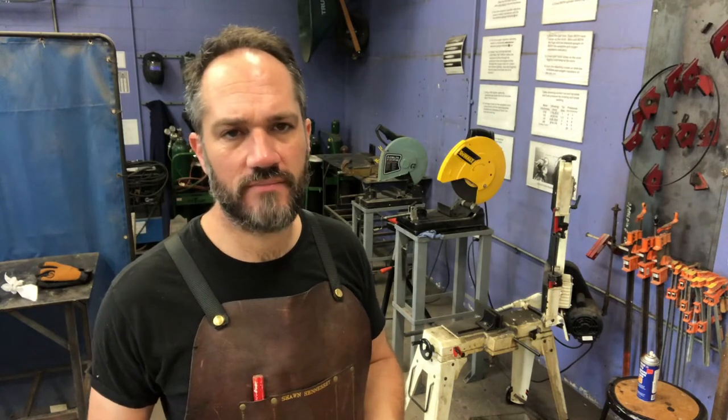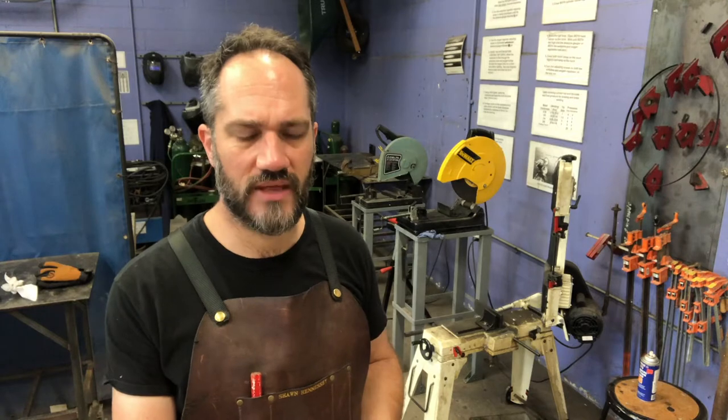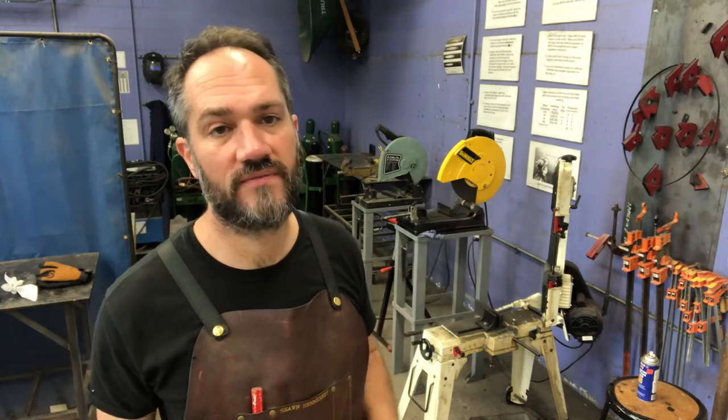You'll also notice that these tools tend to be very dirty, as is everything down in the metal shop. Whenever you work with metal and cut or grind it, it throws off carbon, making a very fine black dust that gets in everything — you can see it on my hands and I've only been here about five minutes. It's a good idea to wear a dust mask or respirator if you're doing a lot of this kind of work, and also turn on the vent fan. You absolutely have to turn on the vent fan if you start welding or using the torch.